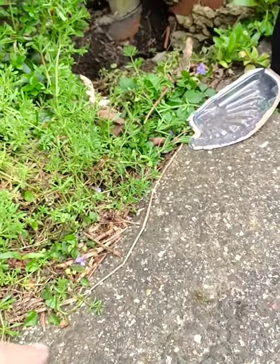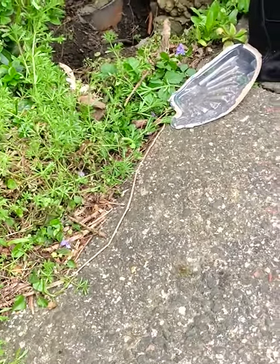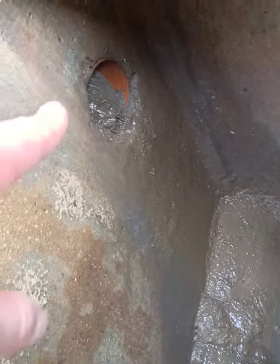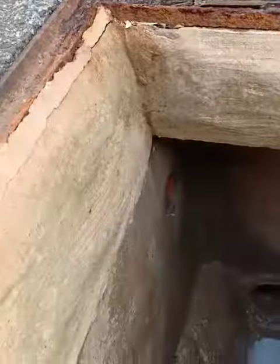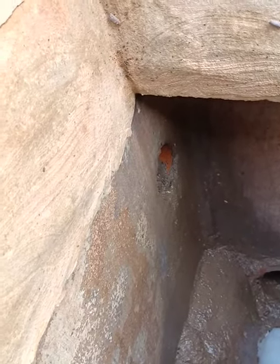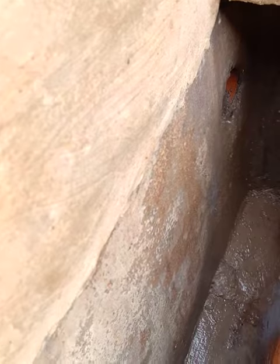So even if that was covered, because there's a break in the pipe somewhere, the rats are still getting through. Ideally it should always be kept clear once you've confirmed that a soil vent pipe is present, so that the system can still breathe.